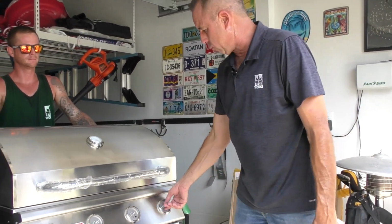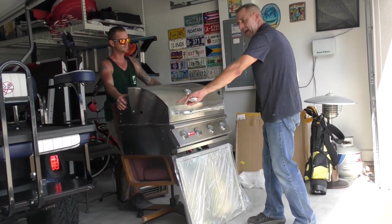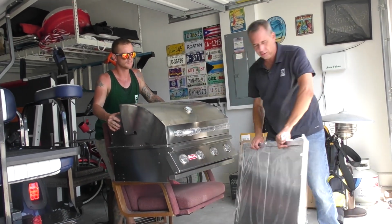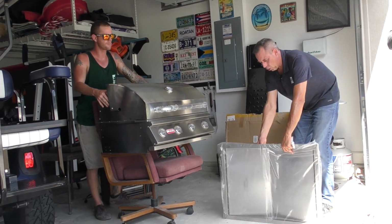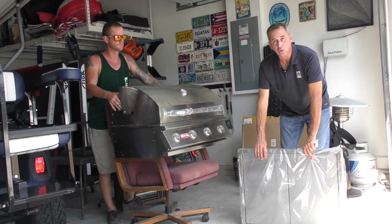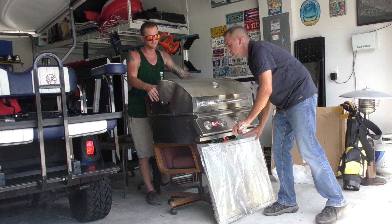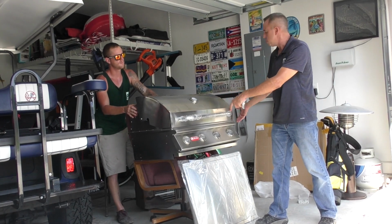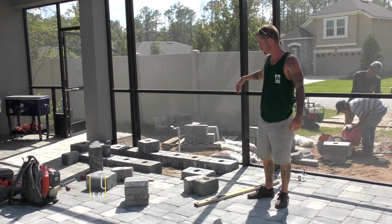We'll have our hardware for all our 3-burner, 4-burner grill here, and it'll be all encased with a retaining wall and a piece of granite. When the doors actually go in to the retaining wall, we'll have to shoot screws here on the inside. So the doors will actually be opened, and then we'll reach inside and we'll shoot our screws so it will be actually fixed to the retaining wall. The drop-in grill itself just gets slid in there after the granite's templated, and it will not move because weight will hold it down.